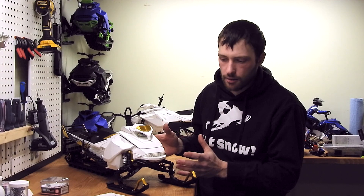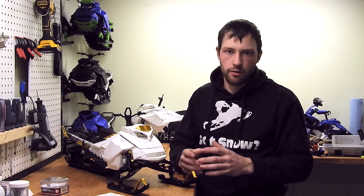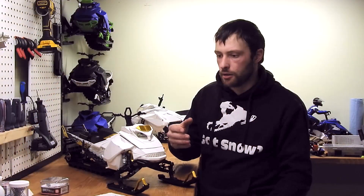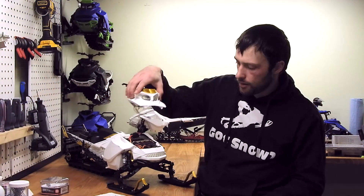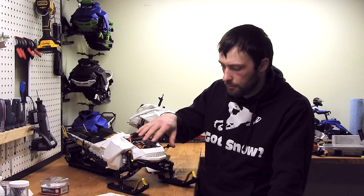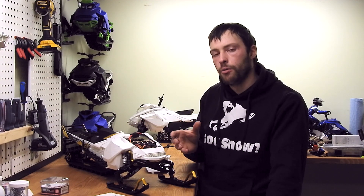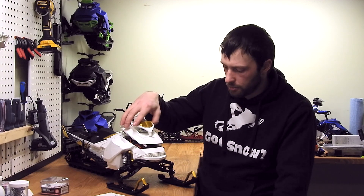Most of the basic electronics have been covered. What's left is all the fancy stuff. The original speed controller was so long that I needed to remove some of its capacitors — they're all connected in parallel, so you can just add them elsewhere. I removed the original capacitors to make it shorter, and that allowed me to have an external capacitor pack right here in the front: four big capacitors, each 1800 microfarad, totaling 7200 microfarad overall. Plus there are a few already in the speed controller. Big gauge wires ensure it can output the power needed.